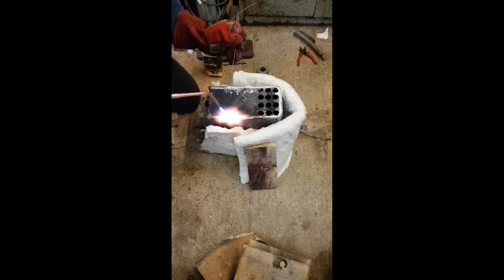The flux is Tenacity number 5 and really does a good job — it has a long life and can withstand temperatures of up to 900 degrees. It's really amazing how the oxypropane allows you to build a nice fillet and push the solder to where you need it.